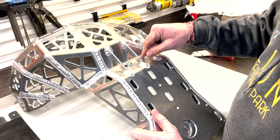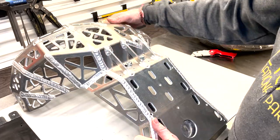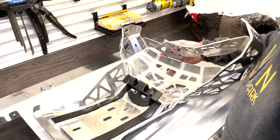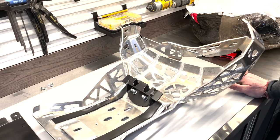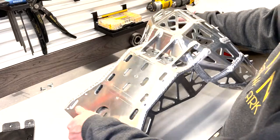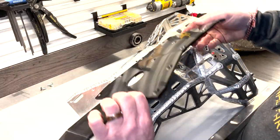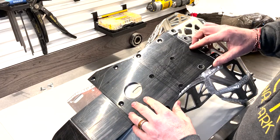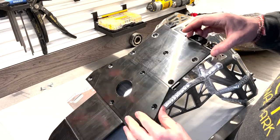If you do pick something like this up, one of the things that we've noticed is that some of these bolts may rattle out. I would really consider using red Loctite, at least blue Loctite, when fastening this thing together. Everybody I know thinks that red Loctite never comes off, but that couldn't be further from the truth. It comes off easy. When I get this mounted, I'm gonna show you a beautiful picture with this.